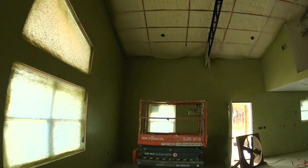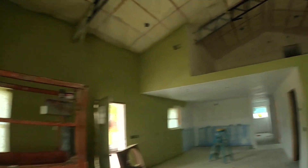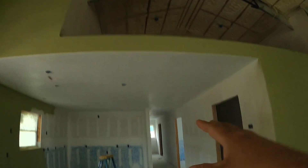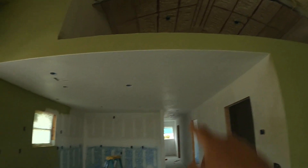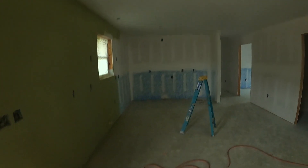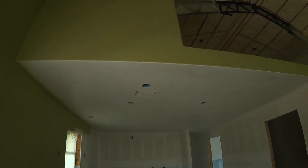But I have a lot more painting to do, so I will gladly take some of your suggestions because it may help me with finishing the paint in the house. Actually, all the bedrooms and pantries and bathrooms are going to be a certain color that we don't even have yet — we're still trying to pick it out. It's time to roll. That means we can take the plastic all off, get some light in here, which should help me see what's going on. And I think I'm going to roll this ceiling in the hallway, because I'm noticing a few dry spots, especially with the light coming in the window back there. I think the roller's going to be the ticket to take care of that. Plus, I'm just tired of the mess the sprayer's making. I think it's time to slow down and just do it right.